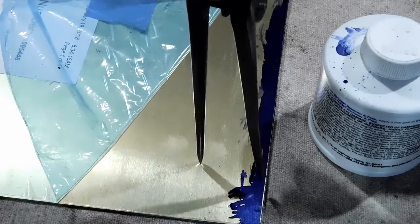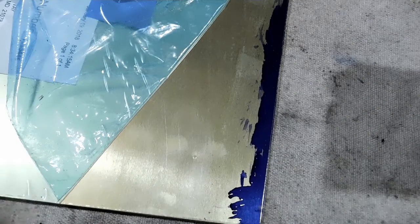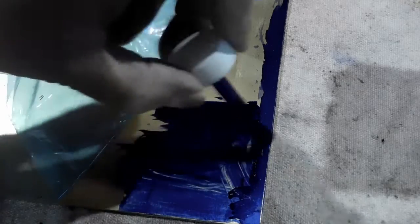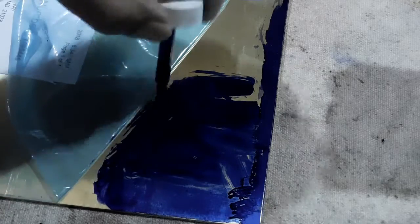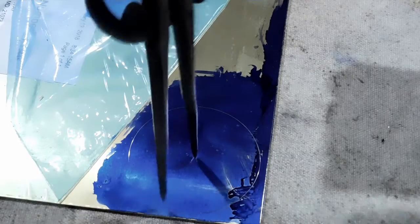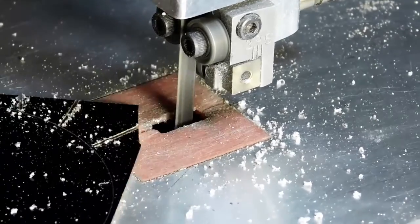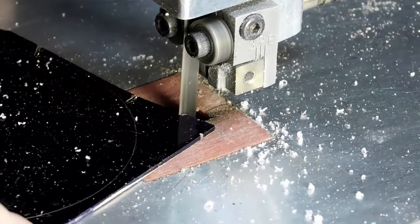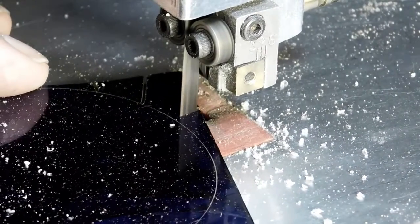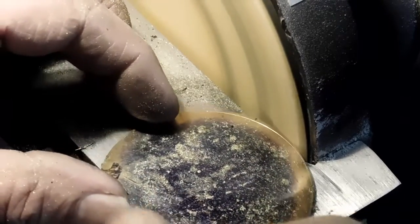I started with a little bit of engravers brass and some Dykem. I've sped this up a little bit — I'm just voice-overing it now. I'm making the circle for the center wheel on a clock that I'm building. That's engravers brass — it's a little hard but it's about one percent lead. I've got the blank over to the bandsaw, using a little bit of wax cutting this, and I'm cutting the verticals in here so that I can cut this thing out.